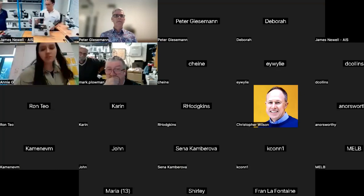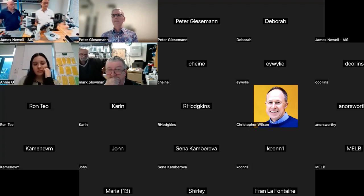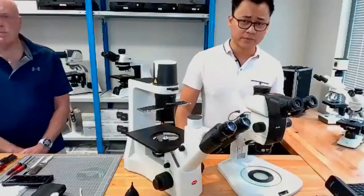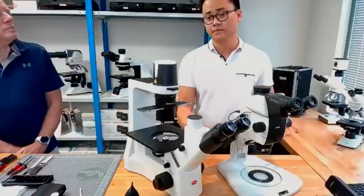With stereo microscopes as well as inverted microscopes, the three main areas you'll be focusing on when maintaining it yourself would be the eyepieces, the auxiliary objectives if you have any, or the objectives if you have the inverted, and the touch points. Be mindful that touch points are usually rubberized on higher-end models, so avoid strong solvents. Use diluted ethanol, diluted isopropanol, or methylated spirits diluted to less than 50%. Any higher and you'll start breaking down the rubbers — it'll feel sticky and eventually fall off.